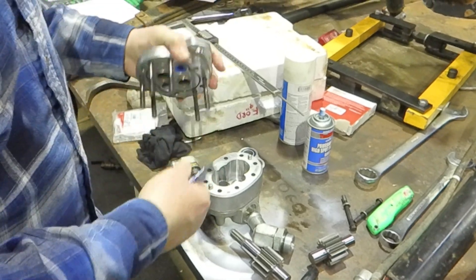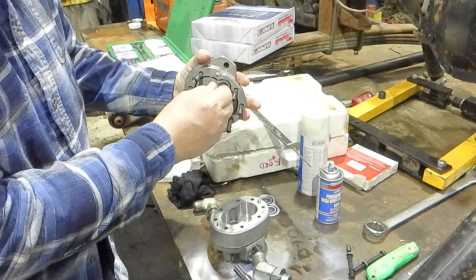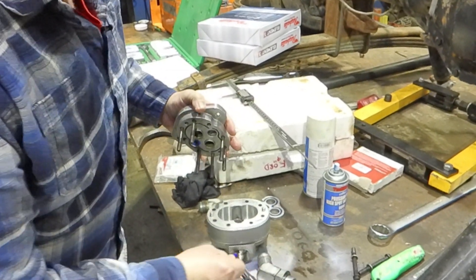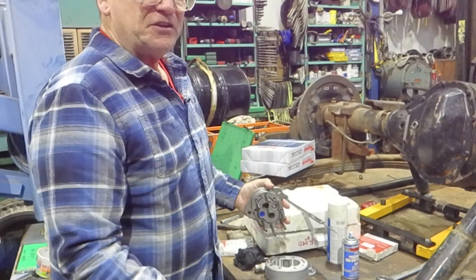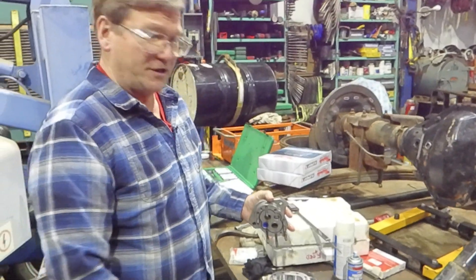It's very important that that pressure — and on this one, it actually tells me which way this goes — that port has to line up with the side that is the intake. The intake on a pump is generally the bigger one, because with suction you've only got atmospheric pressure of approximately 15 psi pushing your oil in.